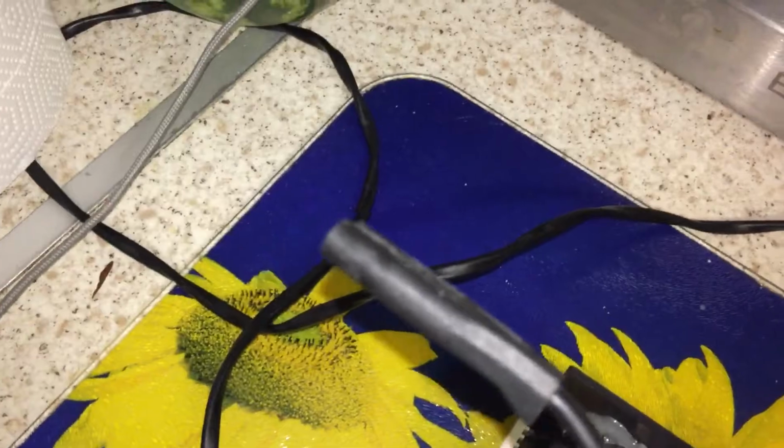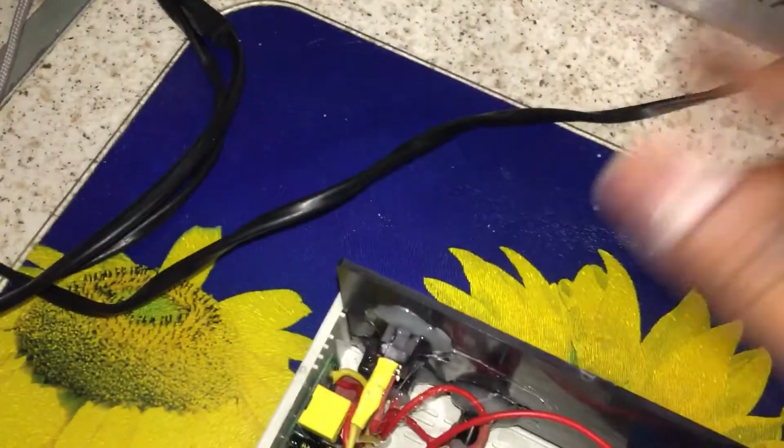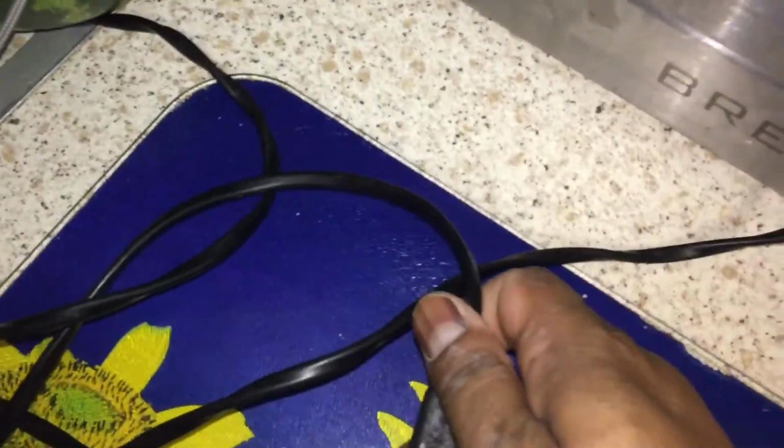So what we do, first things first, is we have a figure of 8 cable. I did it this way, but you can actually use an IEC, a big one of those IEC kettle plugs. It has a built-in fuse, switch, connector. It has everything all in one. I've got loads of them, but I didn't want to use the kettle lead. I wanted to use a figure of 8, because of the earthing. This doesn't need earthing, so I didn't need the third pin.